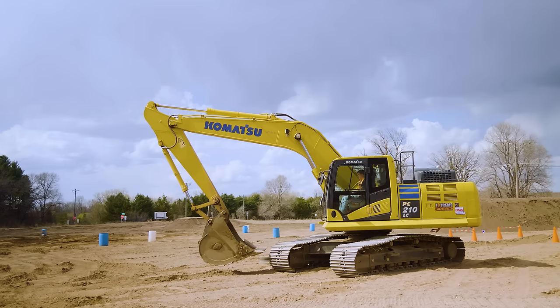And then eventually, this is where you just want to flatten the bucket out. And I can use the side of the bucket, kind of like a dozer blade almost. I slide through this. You don't ever want to do this with a lot of material. Again, this will put a lot of strain on the side, a side load on that bucket, so it's not great from a maintenance perspective on your pins and everything. But again, if you're just trying to finish it up at the end of the day, this is most likely going to be your best bet at getting that.